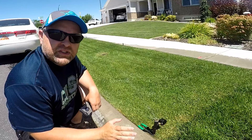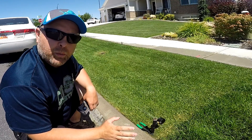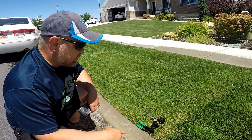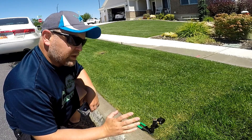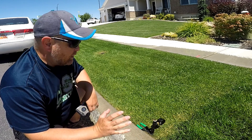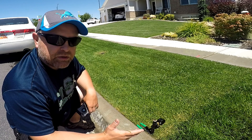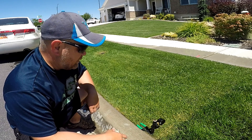The pressure for just this one zone is sitting at about 32 to 34 pounds per head. There are 35 heads on this one zone — all my mow strips — so I expected the pressure to be less. That's one of the things I love about these: they run on low pressure really well. However, if you drop down to maybe 22 to 24 pounds of pressure, you might start to see a significant drop in coverage.